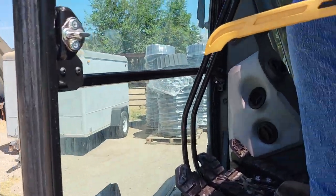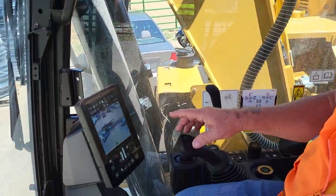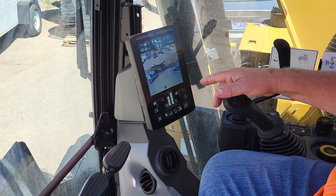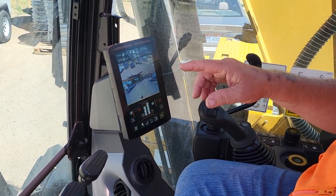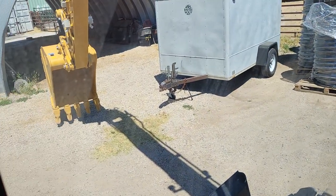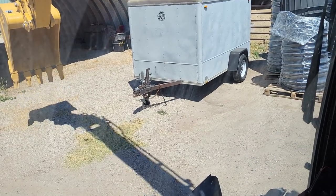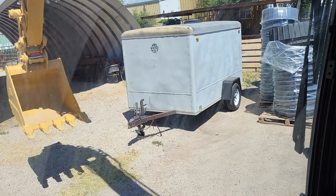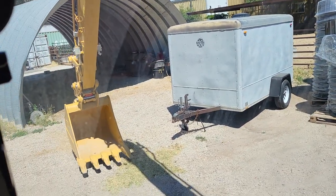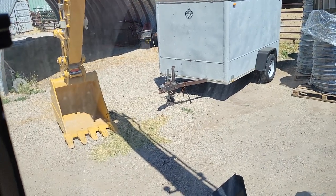You can climb up — I've got your boards to stand on. With this setup in grade control, everything is based off the tips of your bucket teeth. That would be your bench right there. It doesn't matter what position the bucket's in. If I'm cleaning up a trench and coming in like this, it's all still off your bucket tips.